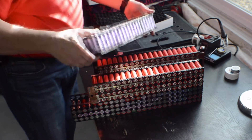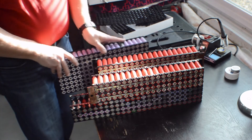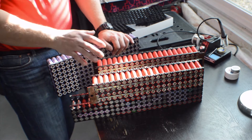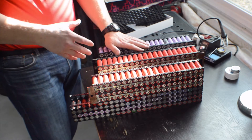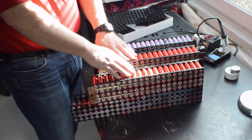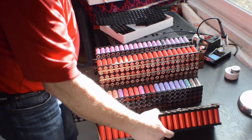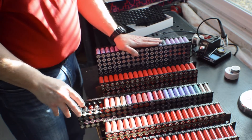The other reason I'm doing it this way — I'll have them in groups of three — is so that at any point in time I can actually remove one of these and the kit stays running. My power pack is still a usable device and I can replace them. So if I need to take one of these out for maintenance, I'm not down. I have less amperage but I still have capacity and I still have the voltage that I need. So let's start tearing these down because the first thing I need to do is start tearing these apart so that I can put them in large packs like this.